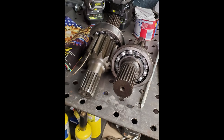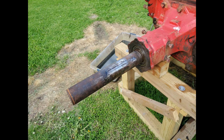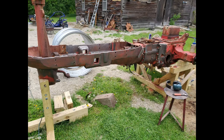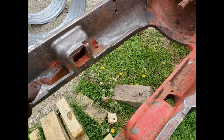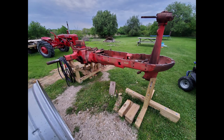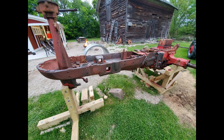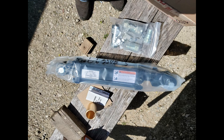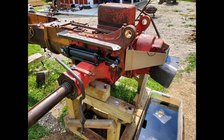The really fun part was next: the painstaking process of stripping rust and paint from the frame. I used a large angle grinder with various wire wheels all over the entire chassis until it was fully down to clean bare metal. In the hard-to-reach places I used a small pneumatic angle grinder fitted with Scotch-Brite roloc wheels or small sanding attachments. While the frame was in this stripped-down state, it was the perfect time to mock up the fittings for a 3-point hitch. This tractor didn't come with one, but it had onboard hydraulics and provisions for a rock shaft, which I was determined to take advantage of.